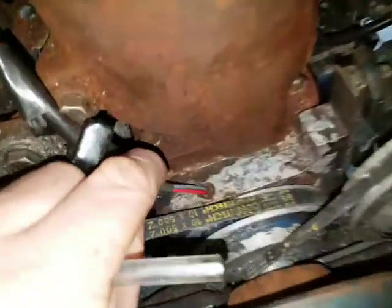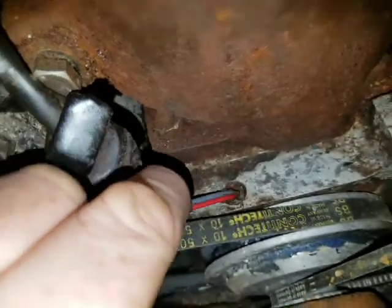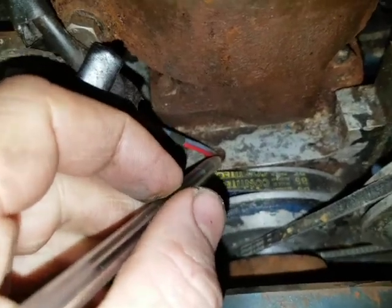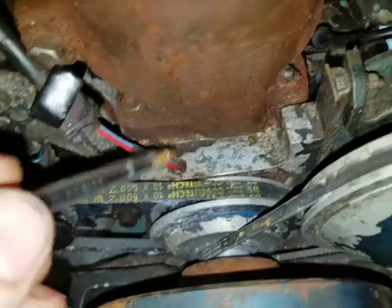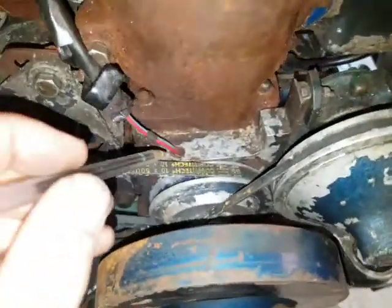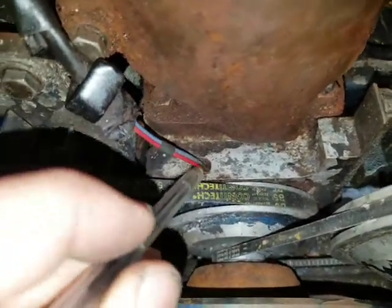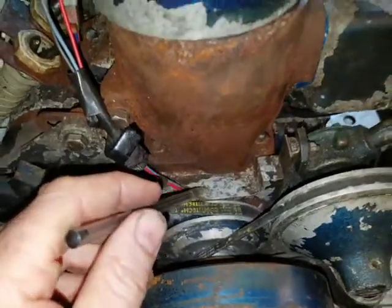What really worries me is that salt water can get down that hole. There's a cavity down there. It's not sealed off or potted at this hole, so that would fill up with condensation and salt water quite easily. And then what's the consequences of that? I don't know. But if getting that filled up with salt water is going to cause an ignition problem, to rectify it is nearly impossible, because this is part of the engine.